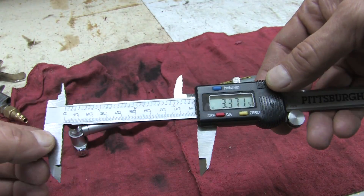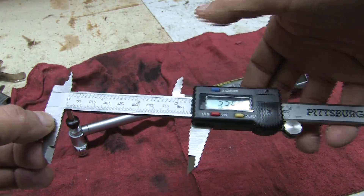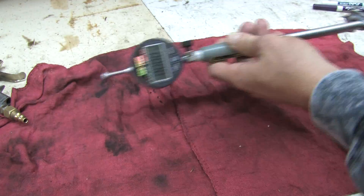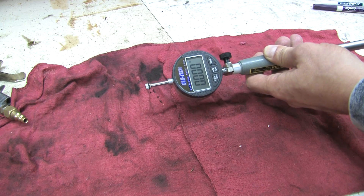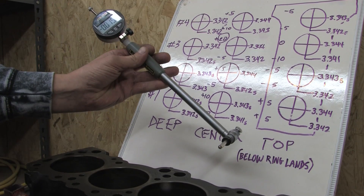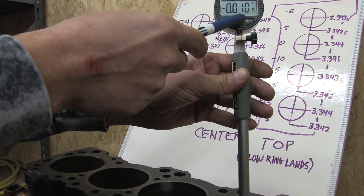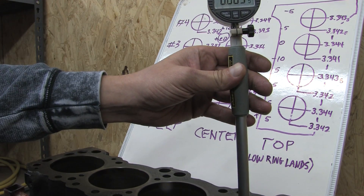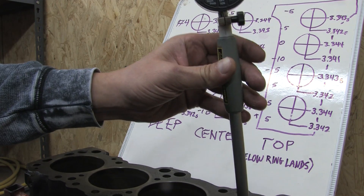So why would I put myself through all this? Everybody knows I have a dial bore gauge, and I've converted this over with a digital indicator on top so that we can more quickly go through these things without having to do a whole bunch of conversions off a dial. After all, we only need to be accurate to a thousandth of an inch, and this is accurate to a half-thousandth. I'm just going to insert this in here, and as we pull back towards us you'll see the number increases and gives us a value — the highest value it reads is the value we want.